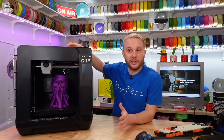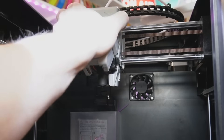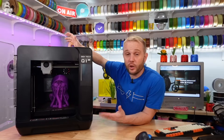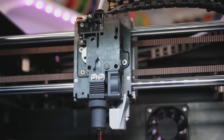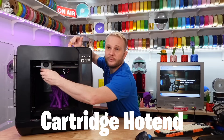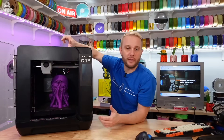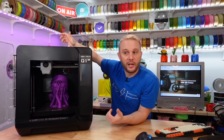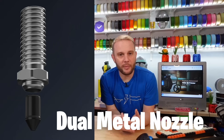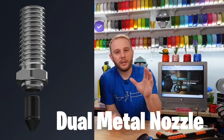In this particular machine, this is a new tool head with a new design. The front plate just lifts up and pops off. The hot end is not a quick-change hot end, but it is one of the new cartridge styles that are becoming more common. Pull this off, and there are two little bolts — pull those bolts and you can remove the hot end.